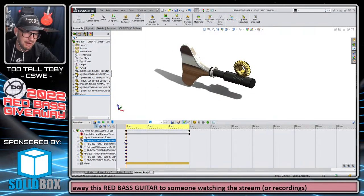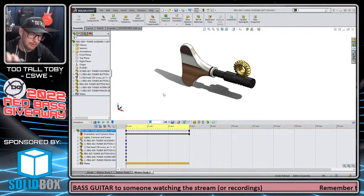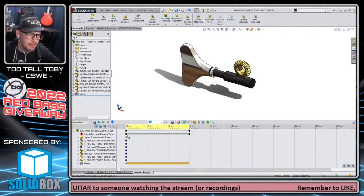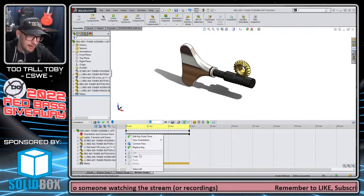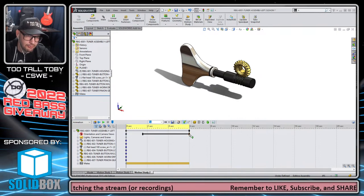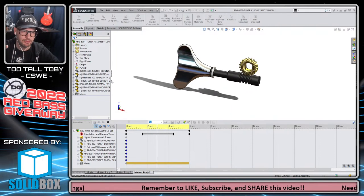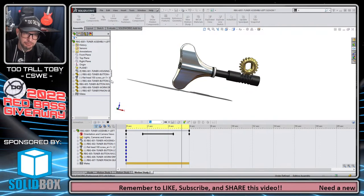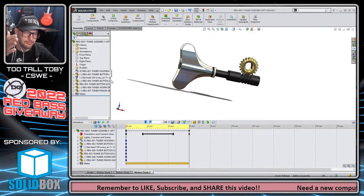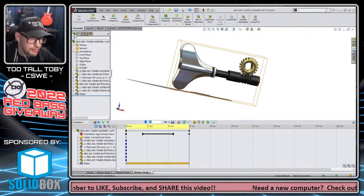It's because you have a key there in that view that's locking the current view orientation. So if we wanted to make that a little more dynamic, we could take this view, say copy, move forward a little bit, say paste, take this view, say copy, move back a little bit, say paste. Now when we start the animation, it starts out in this view, then begins to rotate to the new view, then stops rotating, and the timeline continues for the remainder of whatever's going on in the timeline. So that's camera view orientation.